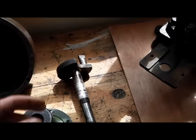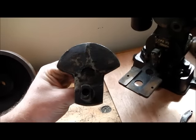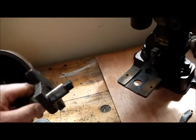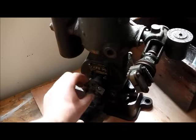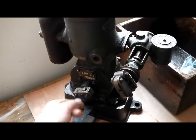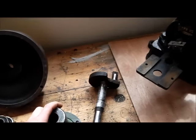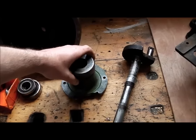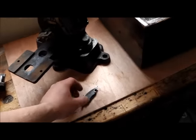The crank itself is going to need some fairly major repairs. The crank pin looks a bit messy but I think we'll be able to use it again. The main concern is the slightly ovalled end of the pin with the flats on it, where it engages with another little crank web at the back which does the magneto drive. That's kind of the same wear as we saw on the Stuart N3 project, so a similar sort of repair is required. I'm going to have to learn the art of metal stitching for that repair — it shouldn't be too difficult because the piece that's come off is nice and complete.